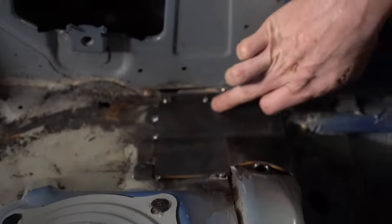So you guys are about to see our first notch. General rule of thumb when you're doing tube notches is you don't actually need to go the full radius of the tube, or like half the diameter, with the hole saw, because when you cut through the tube, if you're doing the full radius of the tube, you're gonna be left with two sharp points here and here, and you actually want those to be flat, and it gives you a nice weld prep.